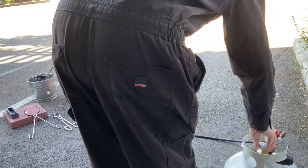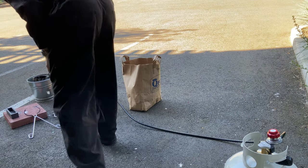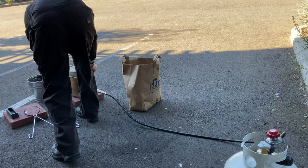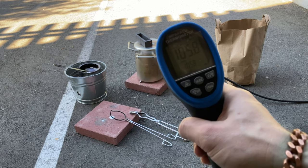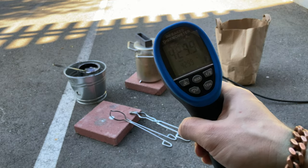Aluminum bars from PopCans. Turn the propane on like this, light the forge, put the lid on. We're going to preheat the graphite mold, check the temperature — since we're at 400 we're good.